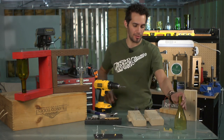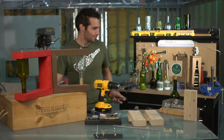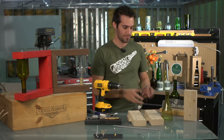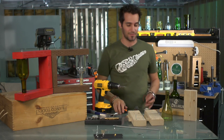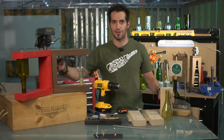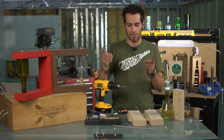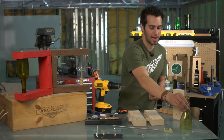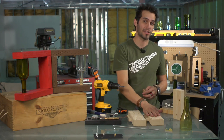The first thing we're going to want to do is measure the top. Take our tape measure — you can see this one is seven and a half inches. When we cut these pieces of wood, this is the fun part — this one has to be seven and a half inches; this is going to be the vertical piece. These two horizontal pieces can be whatever length you want depending on what you want to hang. By the way, a lot of hardware stores will cut two-by-fours for you if you ask them to specified lengths.